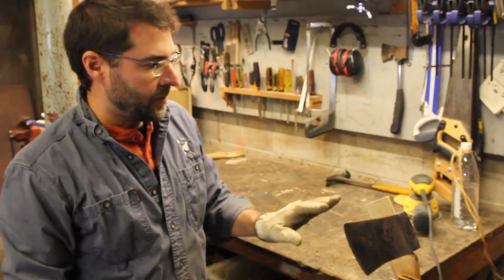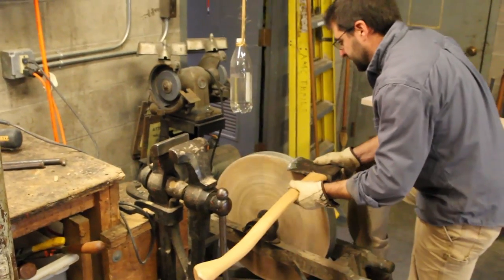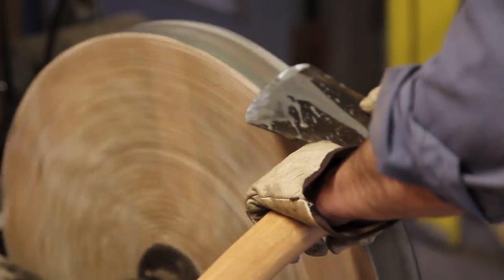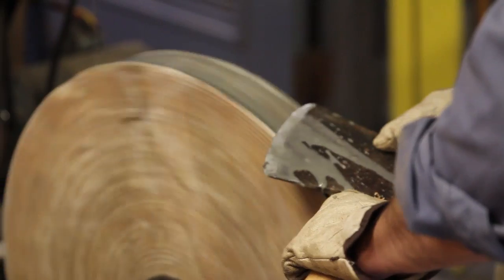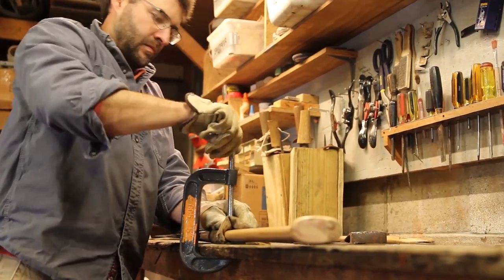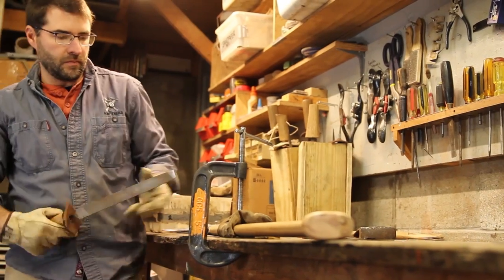So we're hung and we're going to start sharpening. That quote from Abraham Lincoln: 'If I had four hours to chop down a tree, I'd use the first three to sharpen my axe.' This is probably the most time consuming aspect of bringing an old axe back to life. We want there to be a smooth transition from cheek to very sharp blade, and we'll get this to the point where we could dry shave with the axe.